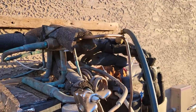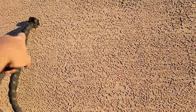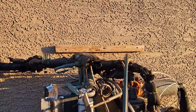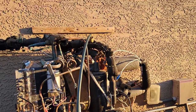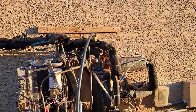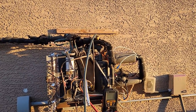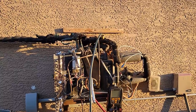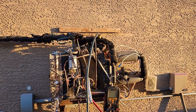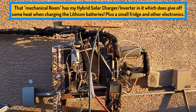Then I took my high-wall and put all these service valves up here. What I have now is: I shut off the outdoor coil for the summer and have it use the one inside that room to cool the mechanical room during the summer, keeping that room at like 88 or so. But people weren't using water during the day, and that's when this thing cools. It was making the water get really hot — like yesterday I came home and the tank was up to 144 degrees because nobody was using hot water, but the thing kept cooling that room down to 88 or 86.